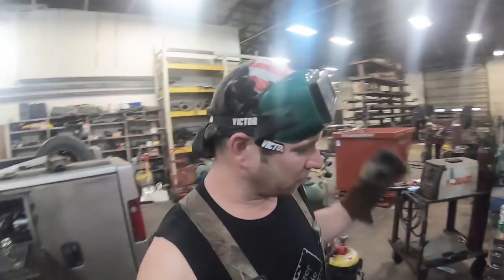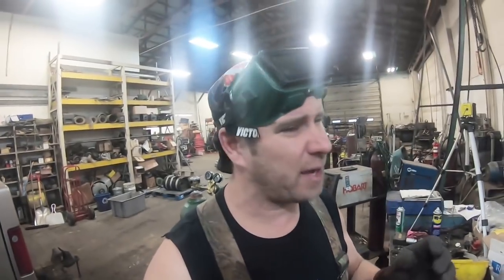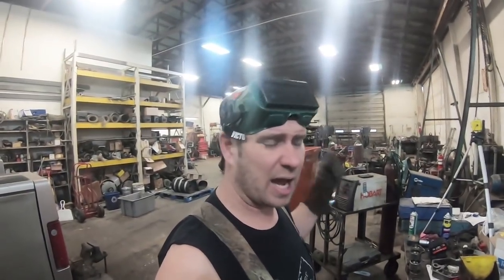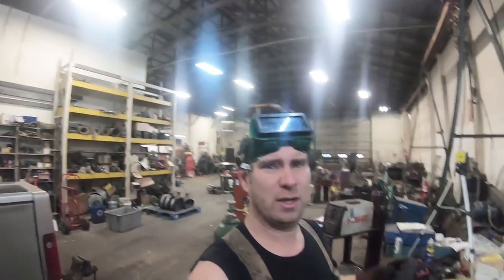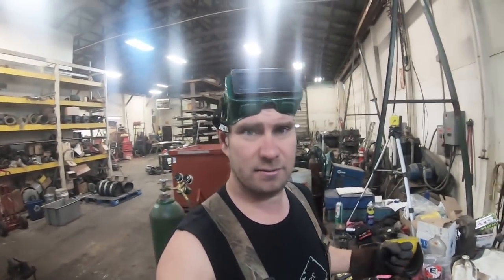Me and Mikey are going to tear into this and I just wanted to share this with y'all. Now I'm not trying to throw anybody under the bus, but these bearing manufacturers — I don't know if it's the manufacturers — through the pipeline of manufacturing and selling, they miss out on the fact that when you're working in a contaminant-type atmosphere with a bearing, you need to purge it. You don't just grease a bearing to lubricate it — you grease a bearing to purge the crap out of it too, because the crap gets in.